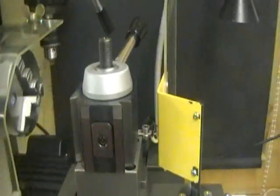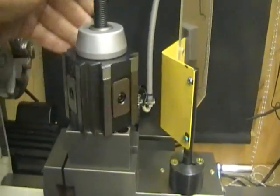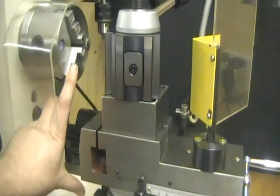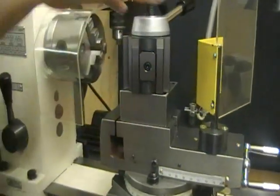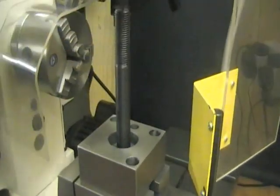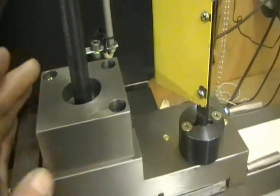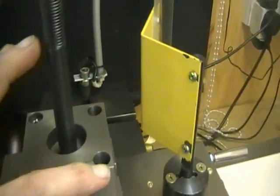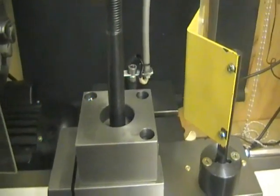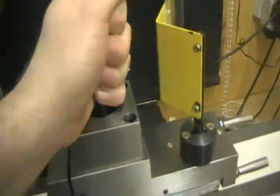The other thing I've done is fit the quick change tool post. Quite a bit of modification was needed because the centre height of this particular lathe is so high — I think it's just under 8 inches, so you have to lift the tool changer quite high. Using the original post and the original block, I've drilled 8mm x 3 into the vice and drilled that block out. That's an M14 bolt which I tapped to M14, so it's nice and sturdy.